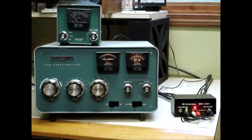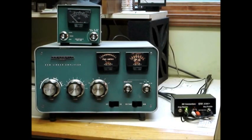If you look at the power meter, we're topping about a kilowatt here. If I put a tone in, you can see we're putting about a kilowatt output, if you can read the Heathkit power meter. Here's what it sounds like in semi break-in — if you keep transmitting you wouldn't hear anything. Now if you put it in full break-in with the amp, you can hear between all the dits and dahs. That's all it is.